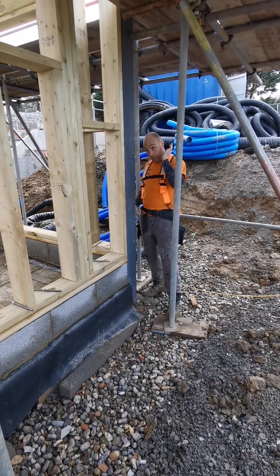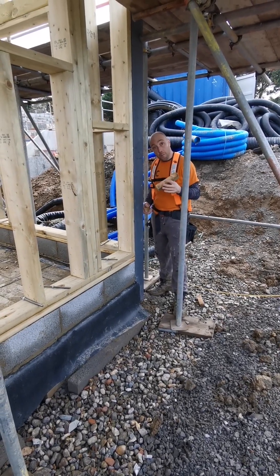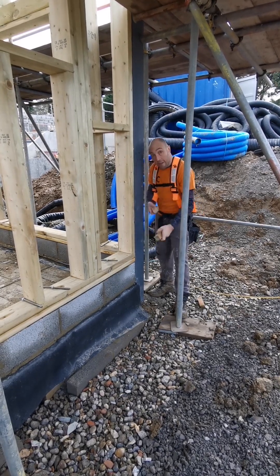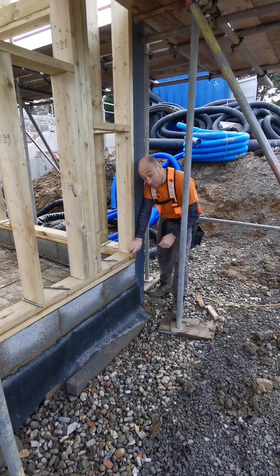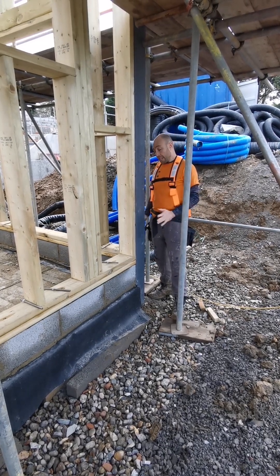Setting out these walls, I really want it nice and straight, level, and to avoid these steels. What I do is get a 45mm bit of timber, clamp it down on the steel, do the same the other end, pin a line all the way. Then I'll have a piece of timber 40mm — 5mm smaller — and adjust my plate to the line.